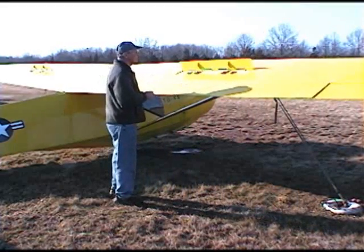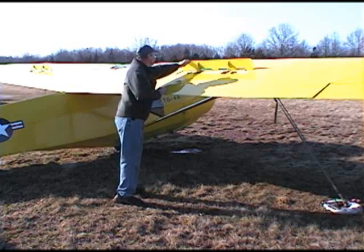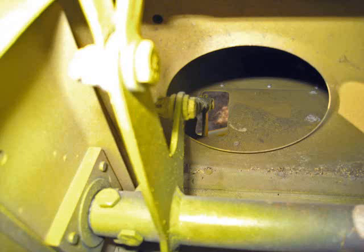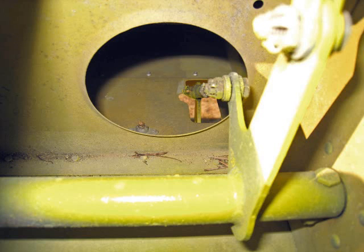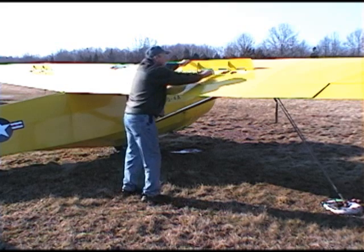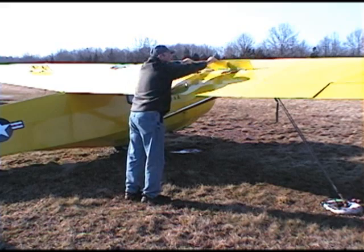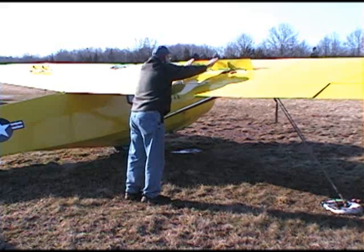As we come to the upper spoiler box, we can look inside the observation points and see the connections with the castellated nuts, safety pins, or cotter pins on both ends of the openings. We can also flex the spoiler a little bit with our hands, making sure the hinges are secure, but being careful so that the spoiler doesn't snap down on our fingers.